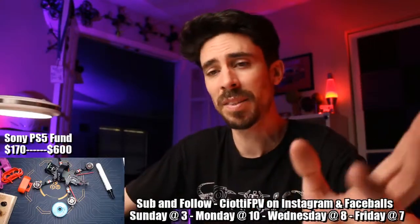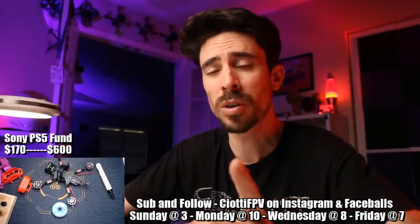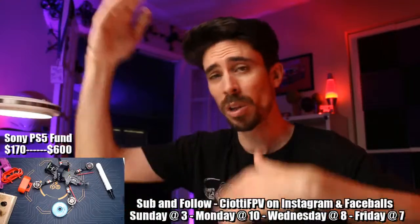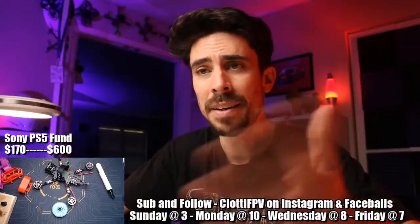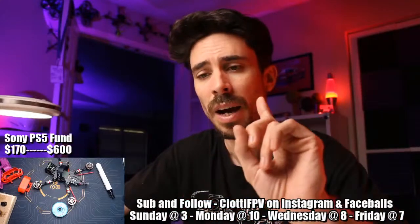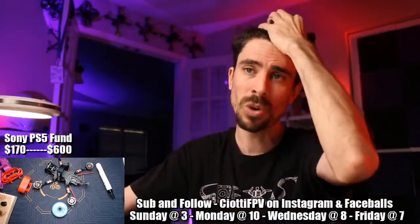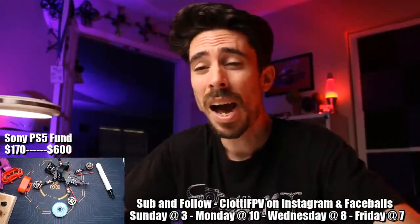And I've blind tested this. I ran two different gliders for about a year and a half. One of them was on 2400 kV on 6S. The other one was on 1950 kV on 6S. Completely identical top to bottom rigs, and they were motor limited down to have the exact same KV, or the exact same amount of power and everything. And there was never a difference in runtime that I could tell in the real world. And there was never even a difference in flight feel. I could not tell the difference between those two rigs in any way. So yeah, in the real world, motor limiting is a free pass, and it's really nice.